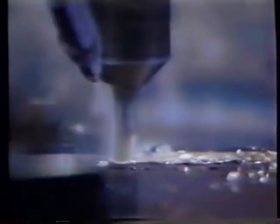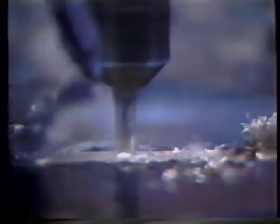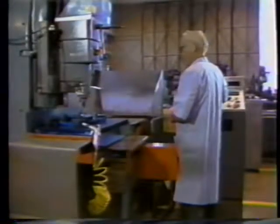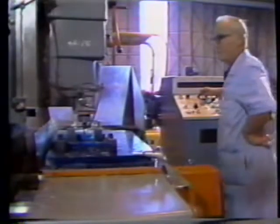A model begins with an engineer's concept that is fully translated onto paper by a model design engineer. The design engineer's specifications are relayed to a computer programmer who transfers the design on paper into a numerically controlled computer that plots precisely each tool path which will cut the model out of a square block of aluminum. Each pass of the cutting bit is controlled in its depth and span of cut. The engineering technician closely monitors the milling operation as the general shape of the model unfolds.